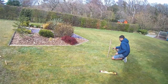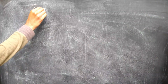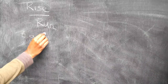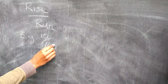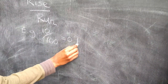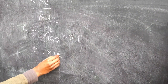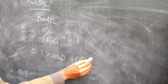Having calculated the rise and the run of the slope you can now calculate your incline. This is done by simply dividing the rise of the slope by the run of the slope, ensuring that both of your measurements use the same units. The actual units do not matter — it can be centimeters, meters, feet, or whatever you are most comfortable with — but both measurements must be the same. You then multiply your answer by 100 to get the percentage incline.